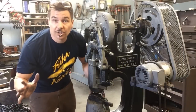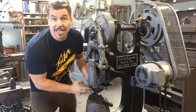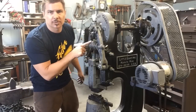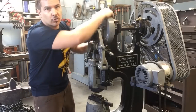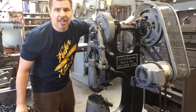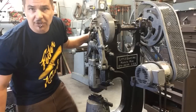Let's do a quick rundown of parts on our 25 pound Little Giant power hammer. We've got our anvil, our die blocks, our hammer, our toggle arms, our tension spring, our crank plate, shaft, two babbit bearings, a flywheel and a clutch back here. We've got a motor right here and on the very bottom we have a foot treadle.